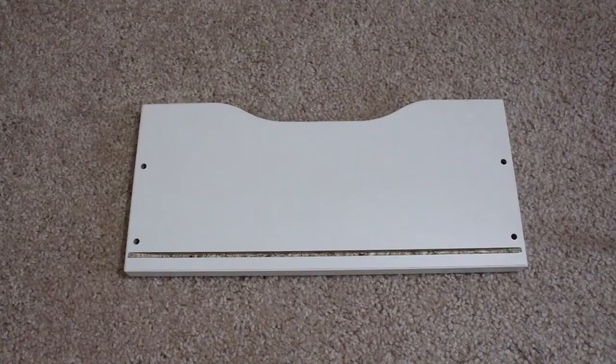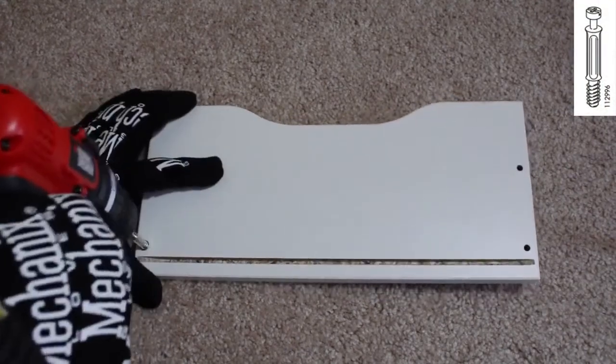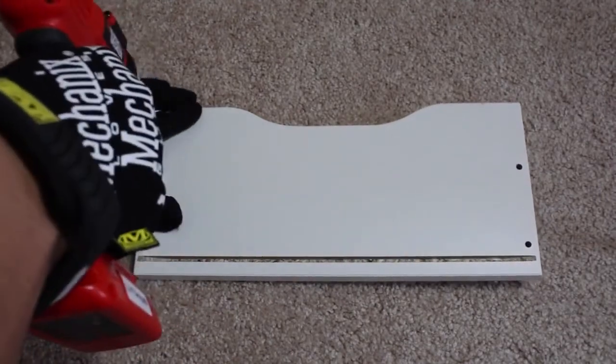Now you've finished the first drawer. Do the exact same thing to the other one and you'll have the 2 smaller drawers finished. Now moving on to the bigger drawer, we do exactly the same thing as the smaller one, only one difference is, instead of attaching the 2 cam lock screws, we'll be attaching 4. No dowels will be used in this step.